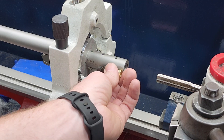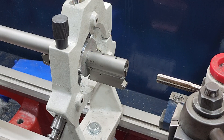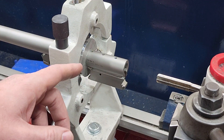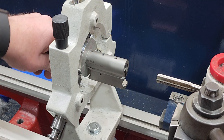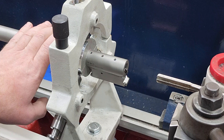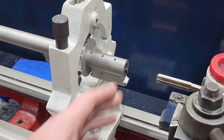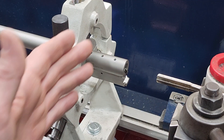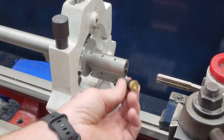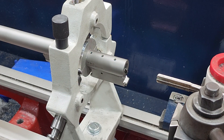The only other critical measurement is headspace, which is pretty easy to set on these. Within a thousandths, this thing's gonna be just as accurate as if it were less than a thousandths — even at five or ten thousandths it probably wouldn't shoot any different. We want the back end of that plug to be parallel with the back of the barrel, so our module will sit flush and flat on the action.